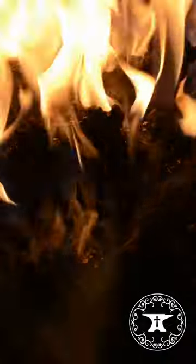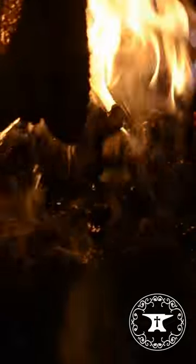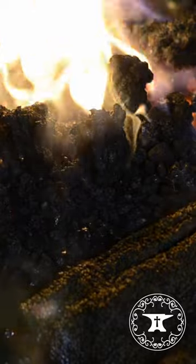The downside to that is look at all this coal burning out here — that's unnecessary. You don't need all this excess heat coming out of your fire pot. The benefit of a swab is that you can come along the sides of your fire and dribble just a little water — just enough to dampen the flames — without getting any water down into the fire pot and risking cracking it. That's the principal point of a swab.